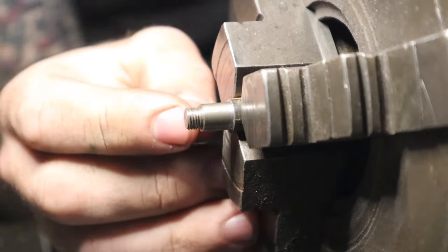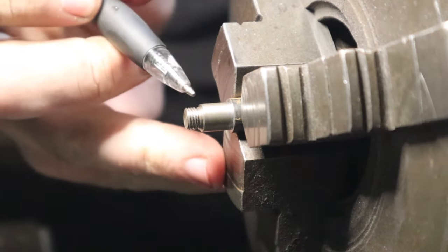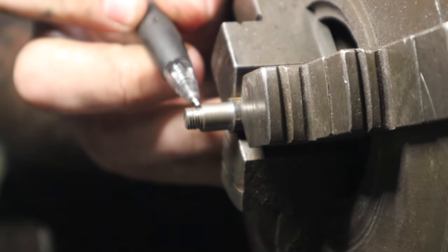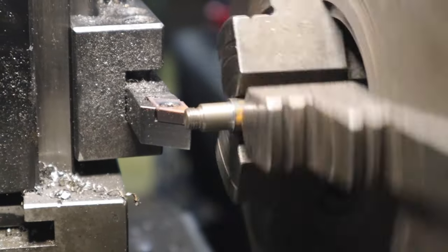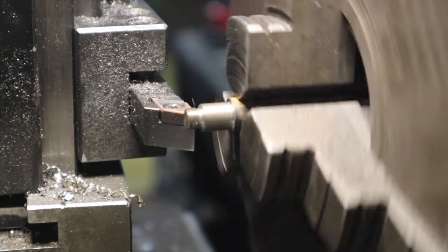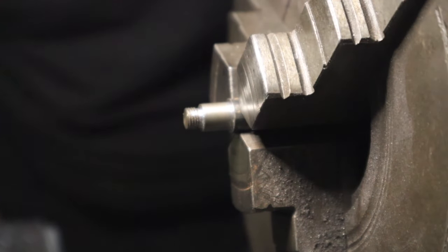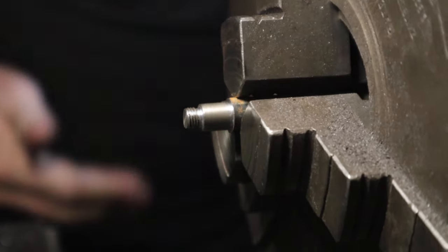One thing I do want to do is clean up this gutter just in the back here — using the finger as a pointer is a no-no. I want to clean up this gutter just so that we know it is not going to impede us going into the action. That all looks pretty good to me. I'm sorry the camera won't stay in focus — it's a very small part and it's hard to do. So while we're in this setup, we're going to drill our firing pin hole because I want to make sure it is concentric to the thread. I'll reset up the lathe for a different gear setting and then the next thing you'll see is me drilling that hole.